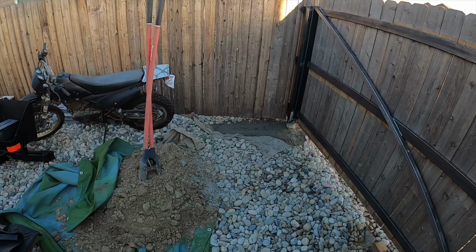Move down to the other side and do the same thing. Square it up and weld it and tack it in place. So this is just a rough squaring up. Once we get the bottom one on, which we're gonna do next, we'll be able to measure corner to corner. And then we'll put a ratchet strap on there if we have to, on whichever direction, corner to corner, so I pull it one way or the other to square it up. And then once we get that square is when we're gonna burn it in real nice and hot.